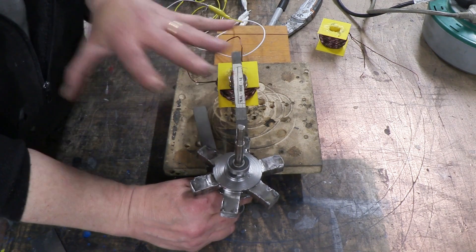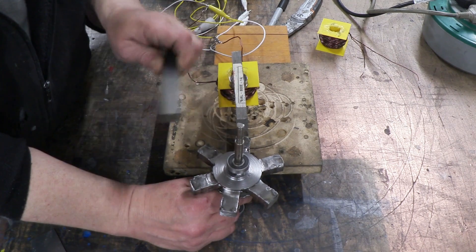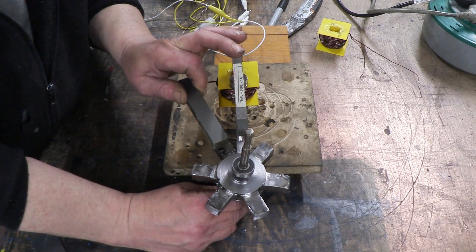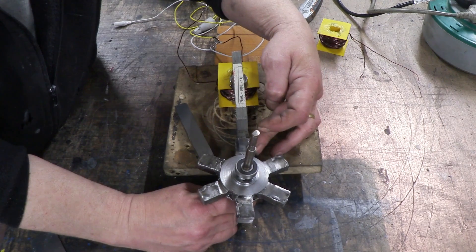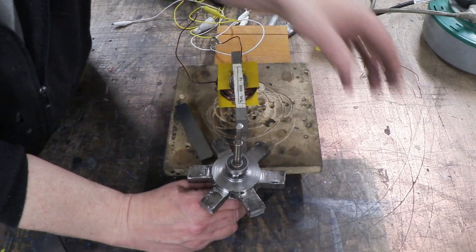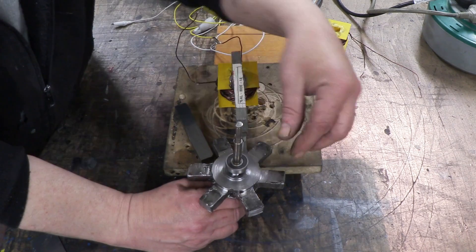But there is no attraction at the moment — everything's turned off. So let's say we put another C right there, and when we've turned this one off we turn this one on. The rotor is in an identical position so we will now rotate to that point of least reluctance on the second C. We turn the second C off and the first C on, and you'll notice the arm is ready to go there. So we can rotate that rotor with only two coils. Even if we put a whole bunch of coils around it to improve the torque, it's still only swapping between two coils at any one time.